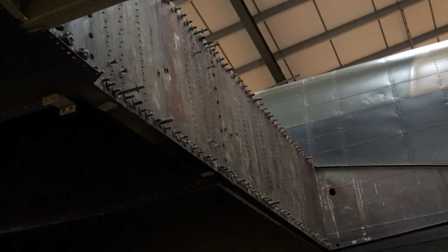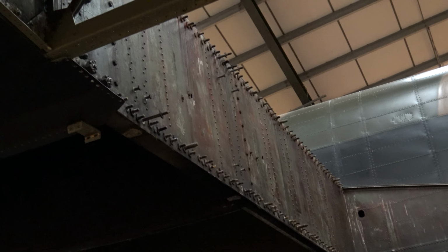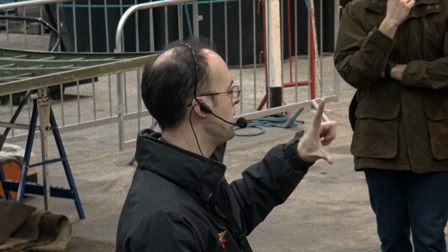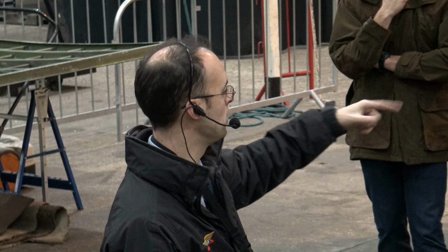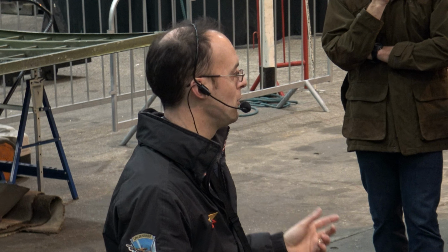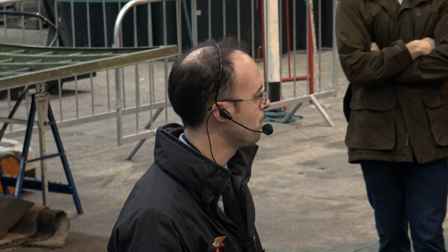So that's been surveyed, it's had new anchor nut strips put in. We do know we have some extrusion to replace on the trailing edges, which is the aluminium angle. It's like an L-shaped angle at the top and the bottom of the trailing edge, which actually are the faces that attach to the spar web. So we know that we've got some of those to replace. We'll either have to replace the full length, or we've got to put a repair piece in. That's yet to be decided at the moment.